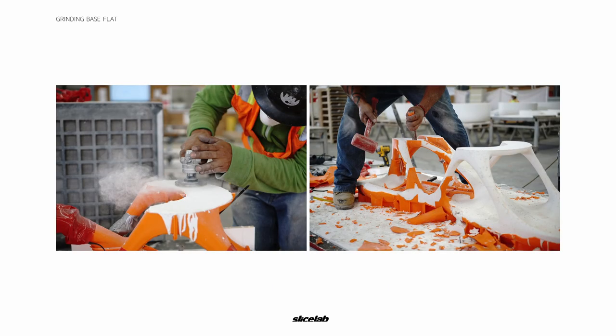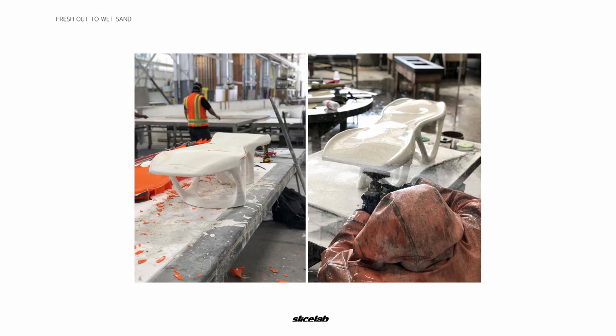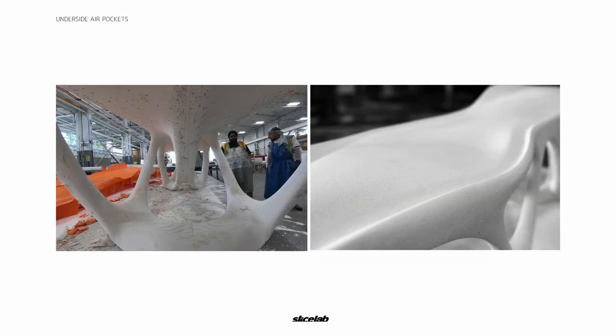Once we were ready to remove the concrete and the mold, we first took advantage of the grid system to create a level surface. We flattened off the bottom of the legs and then grabbed the chisel and mallet to slowly chip away at it to finally realize the shape we wanted. As predicted, the top piece fell off super easily. Because of the smooth finish and the wax floor paste we put on, it was no problem at all — no chisels necessary for this area. On the left, you can see the concrete table directly out of the mold. You can still see the striations from the 3D print molds as well as some plastic and shifting that we had to fix using the diamond wet sander. At the end, we had a really nice finish that looks mirror-like when it's wet. Underneath the surface, the air bubbles were relatively all the same size — exactly what we were looking for — and the top was completely smooth without any abrasions.